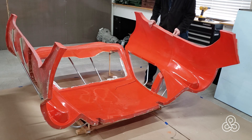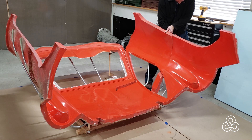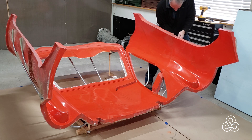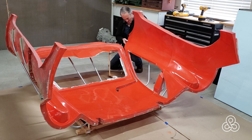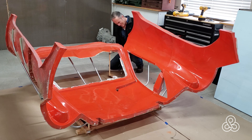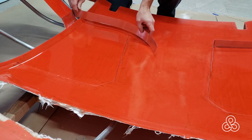Putting the car together — I don't think I actually recorded any of the videos, but once I had all the molds ready I drilled between all the flanges so that they can be reassembled once they were off the car. I've put the door in its position, put a bolt in the back, now I'm putting a bolt into the front — bolts all the way around the perimeter. Those bolts are put in and left kind of loose so that we can insert a flashing.